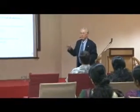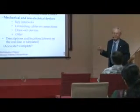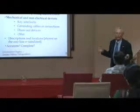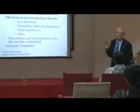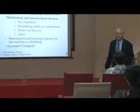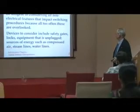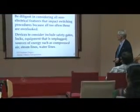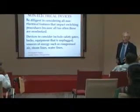And remember, the single line is not a work of art for your own glory. It's a working document for the people who operate the system. So if it helps the system, it's a good addition. If it doesn't help them, then it's probably not necessary. Those are all the other things you have to think about.